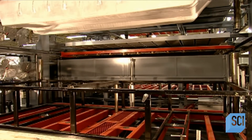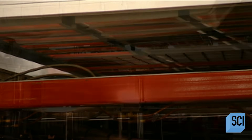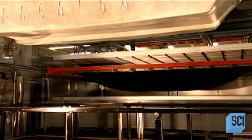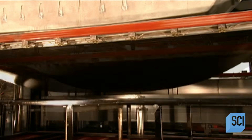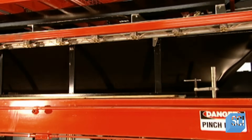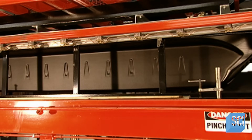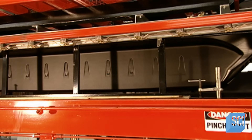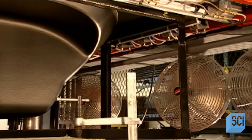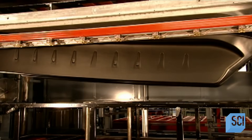To make the vehicle's lower body, they take a sheet of polyethylene — a heavy-duty plastic — and heat it in an oven. After four and a half minutes at 450 degrees Fahrenheit, the sheet emerges softened by the heat. An aluminum mold drops down, and a vacuum-forming machine stretches the plastic around it, sucking out the air from between the two. After the plastic cools for four and a half minutes, the machine lifts the mold, leaving a cavity about the size of a large bathtub.